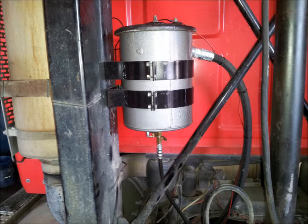Orient the refiner canister so that the return port is facing toward the cab at a 45 degree angle. Install the refiner canister on the brackets just installed using the 1/4-20 by 1-inch bolts, nuts, and lock washers provided in the hardware kit. Once installed, the refiner canister must be reasonably level.